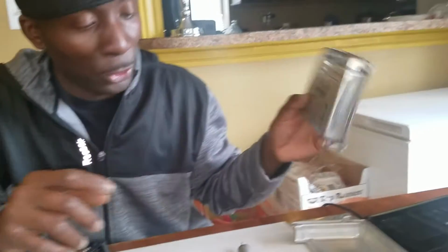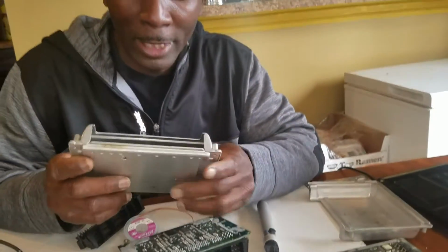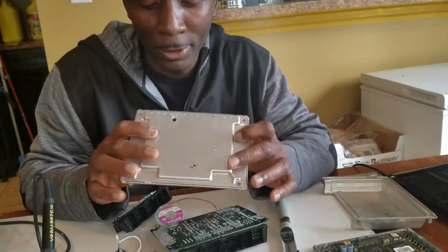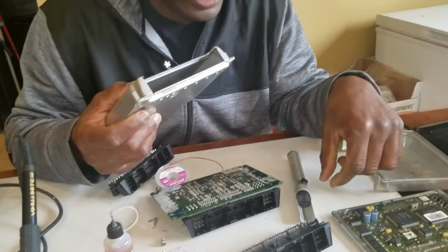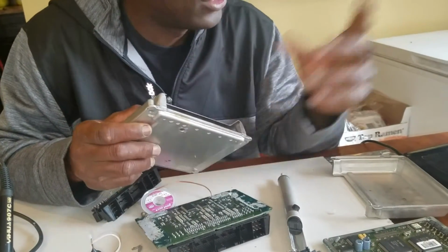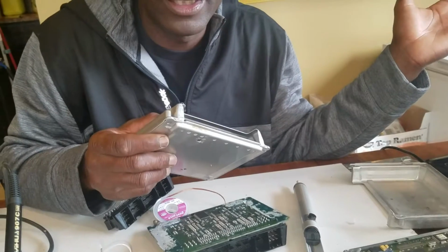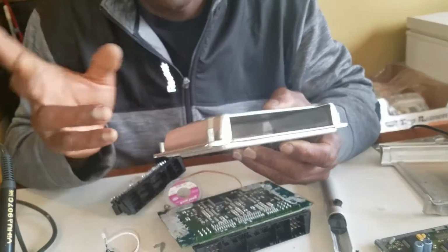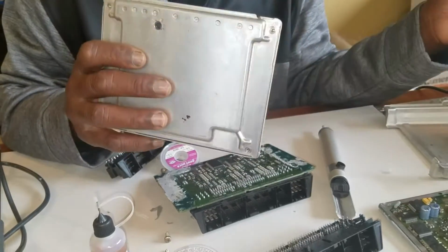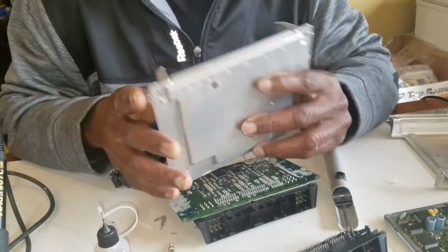At the time I bought this on eBay, I didn't have the donor. It was my neighbor's, and he got into an accident and wanted to get rid of it, so I bought it from him and kept it in my backyard as a donor car. So when I needed a part, I could just do the swap, and I took the whole system, the EWS, DME, the key, ignition cylinder, everything. I put it in mine, but I didn't like it because it's the base model, and I have the sport model, and the VIN mismatch thing bothers me a little bit.